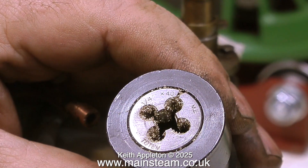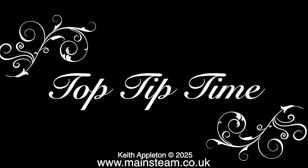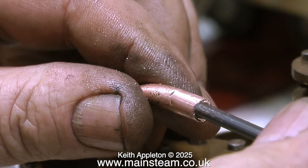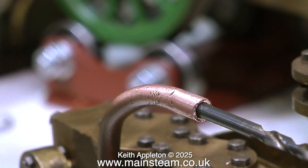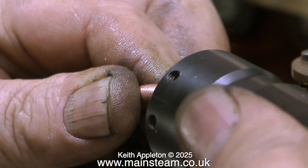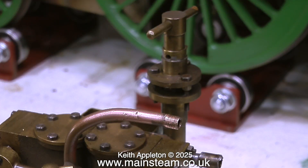The next thing I need to do after cleaning up the end of the pipe is use a tailstock die holder with a quarter by forty threads per inch die fitted. Now for a top tip: it's quite straightforward to thread copper pipe but you must have a support fitted internally. The diameter of the internal part of a quarter-inch copper pipe is five thirty-seconds of an inch, but you don't need to find a piece of bar — just use the drill shank of a five thirty-seconds drill bit. You also need plenty of lubrication, to back off the die to clear chips frequently, and most importantly keep the die holder perfectly in line with the copper pipe. Do all of those things and you should get quite a clean thread like this one.